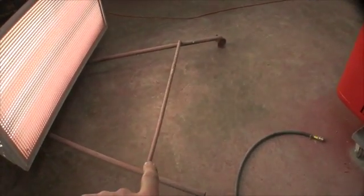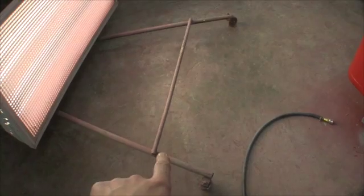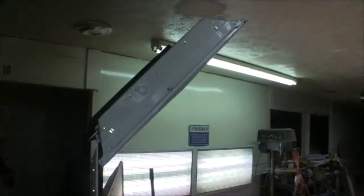This is a homemade job. There's a frame underneath — here's the front. I believe I used three-quarter inch black pipe shaped in an A, so there's a crossbar that makes the cross in the A. It comes through to the back but doesn't come to a point — there's a piece of angle iron welded across. That front part of the A is welded to it, and then there's another piece of pipe on each side to support that, because I have a light hanging on the top.